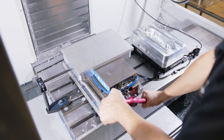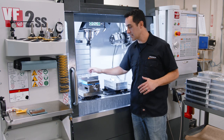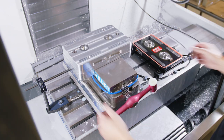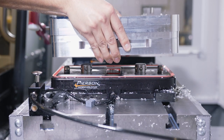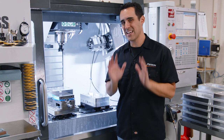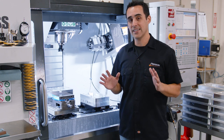We take op zero around the corner on our pro pallet base — it's a preparatory step removing material and relieving internal stresses. Then we put it in the vise for op one to do all the critical holes, dimensions, and flatness. Then we immediately take our fixture for op two, bolt it down, and flip it right over. We knew this would be the workflow for this machine producing our pro pallet bases. After playing with it for a while, we are definitely set — these bases can be reconfigured however you like, but for now this is a winner.